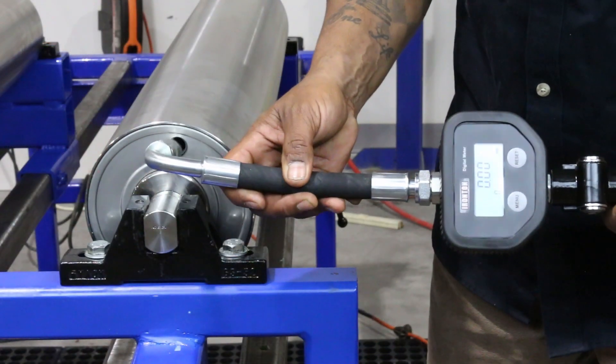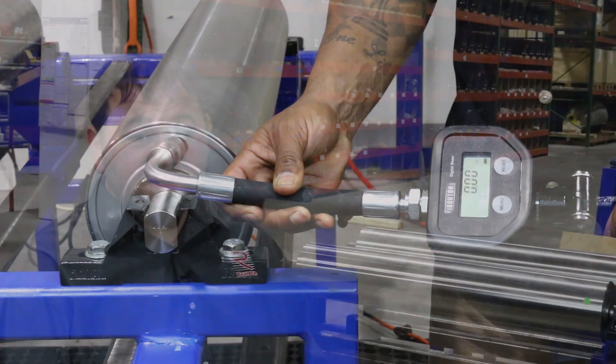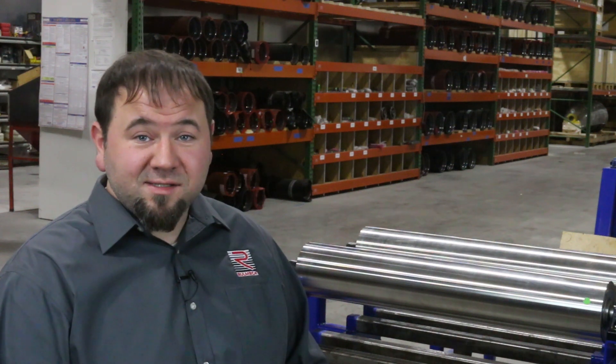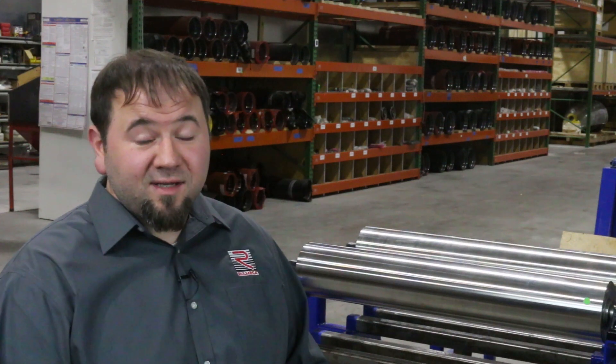Pour an appropriate amount of oil through the upper hole using either an oil fill pump or a funnel and measuring bucket. Finally, replace the upper oil plug after wiping away any sludge and residue from the oil plug magnet and wrapping the threads with Teflon tape.